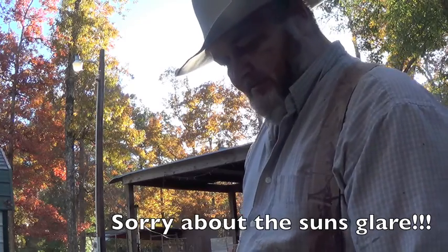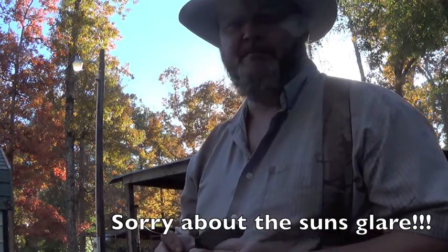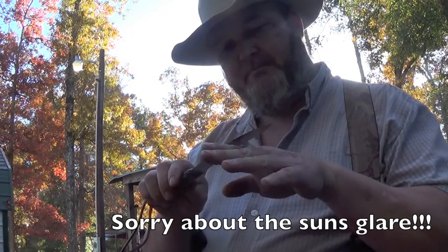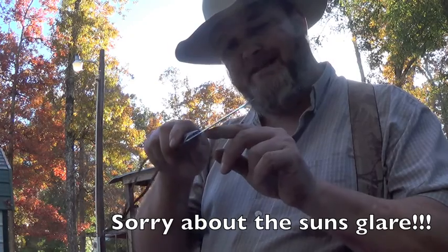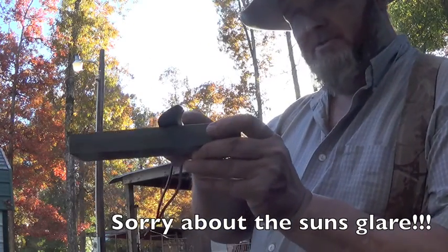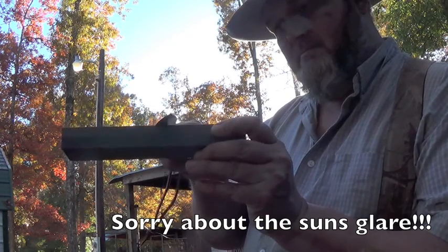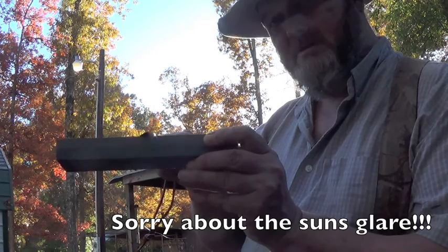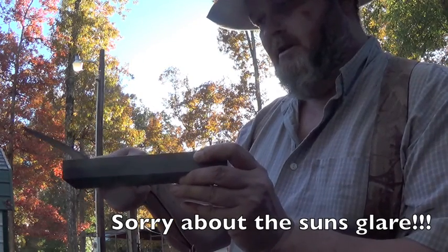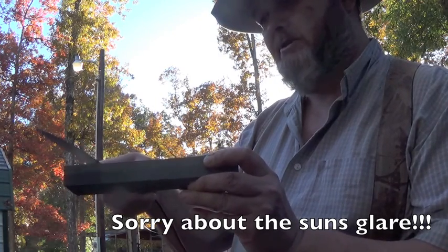But I hope you guys learned something. I hope it was beneficial to you. The main thing that you have to understand is watch the edge of the knife. As you're sharpening, make sure that you maintain that same angle on the stone. Make sure that you follow that same angle all the way through. Take your time. Get real slow with it. This is not a race. And then once you get proficient at it, then you can speed up.